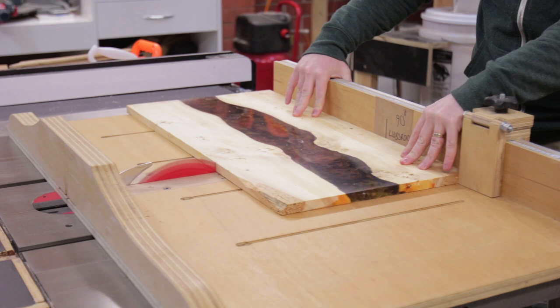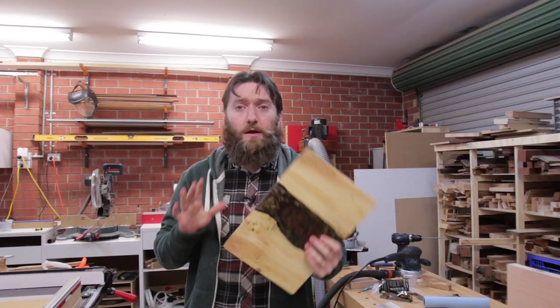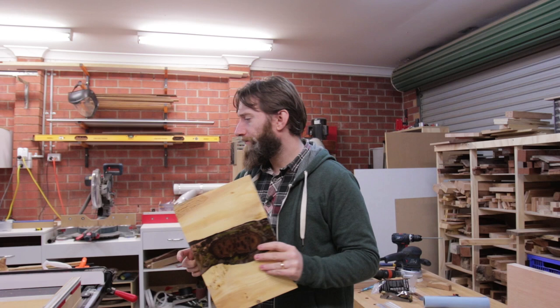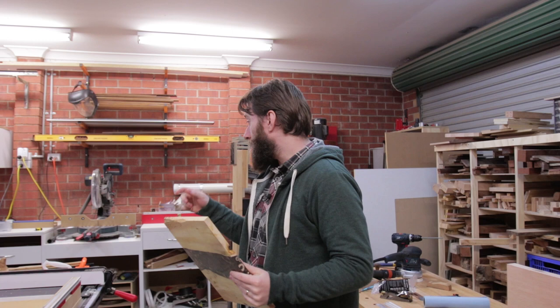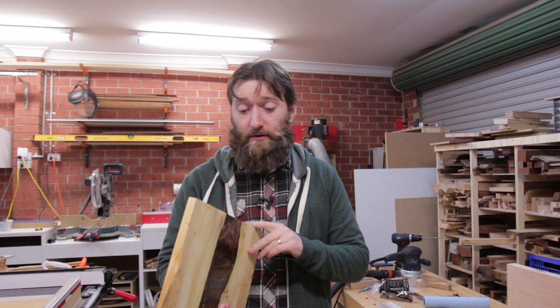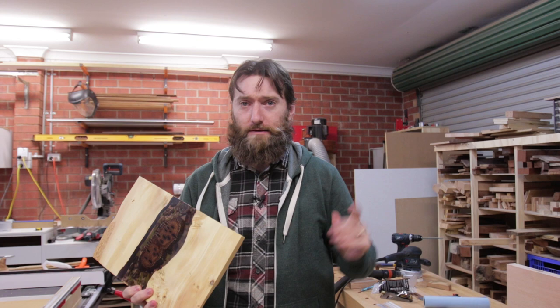Using the cross-cut sled it was super simple to cut it into three, making it an actual triptych. Really super happy with how that's come out. I used a Freud combination blade — a Freud Industrial rather than a Diablo blade. Price is about the same, maybe $5–$10 more on Amazon; I've got a link in the description. It's the LU83R010 combo blade. A dedicated cross-cut blade with 60 or 80 teeth might have given an even cleaner finish, but that is quite a good finish in what is essentially a composite of wood, epoxy, and eucalyptus leaves — quite fragrant in lots of different ways.